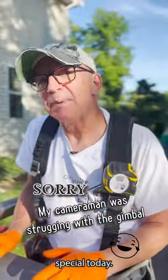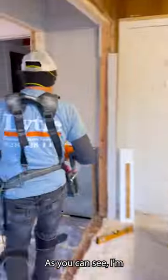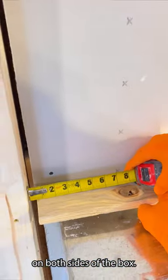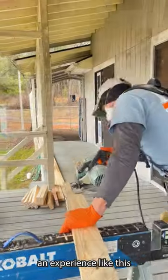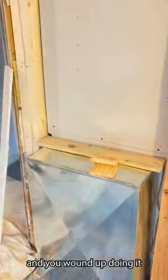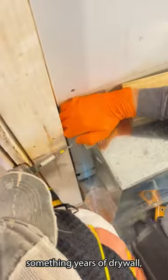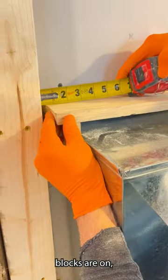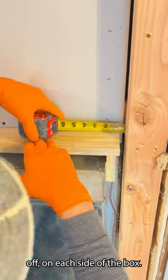You're getting something special today — a 360 view of the project. It's like a drone flying around or something. As you can see, I'm leaving a half inch gap on both sides of the box. Next, I had to cut two blocks. It would be really awesome if you've had an experience like this covering up something ugly and you wound up doing it a different way — I would love to know how you beat the ugly. I've come across many of these situations in the 30-something years of drywall, and each one has brought its own challenge. Now that my two blocks are on, I can put my level line board on, still keeping a half inch off on each side of the box.